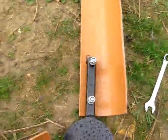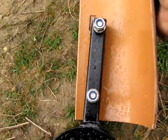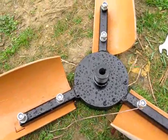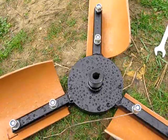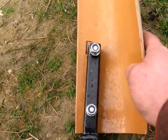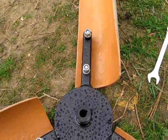On the blades themselves — with two of them the hole positions are just drilled straight through, but the other two have a slotted hole at the top. This is so that I can measure the distance between the tips of the blades to make sure it's the same distance between them all, to give a reasonable sense of balance. Because these are very lightweight PVC blades, that appears to be good enough — they don't hang in any one direction once they're balanced up. The bottom hole isn't slotted because obviously if the bottom hole is slotted you've got far more leverage on the bottom hole than the top one.